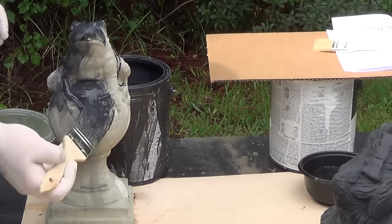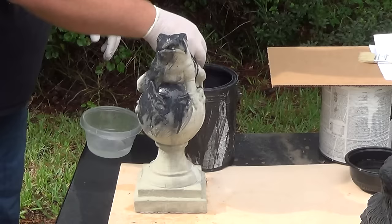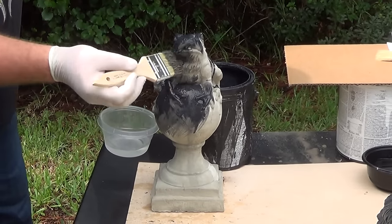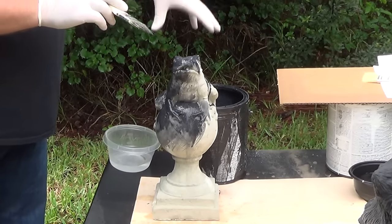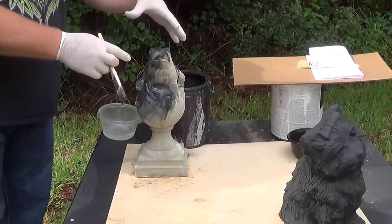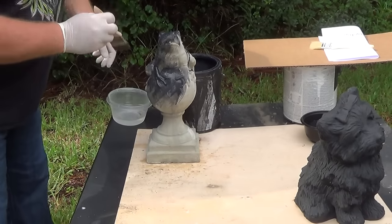The secret here is that the concrete is porous. So when you put water on it like that, it's going to absorb some of that water. And when the water has some of the paint, it's going to pull a bit of that paint into the top layer of the concrete, basically staining the concrete with the paint instead of just painting it on top. Because if you use thick paint on dry, hot concrete, that paint is going to dry as basically just a shell on the concrete, and over time it's going to peel off real easy. This is actually coloring the cement kind of like a stain by watering it.